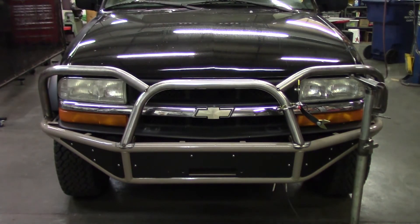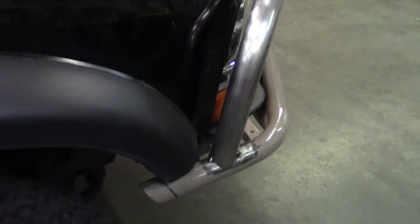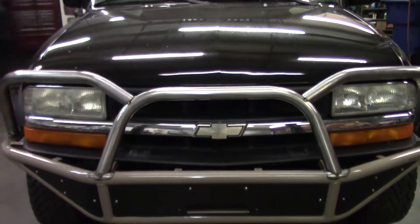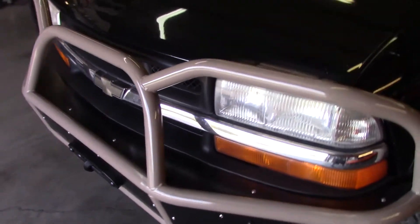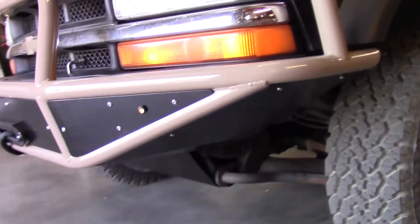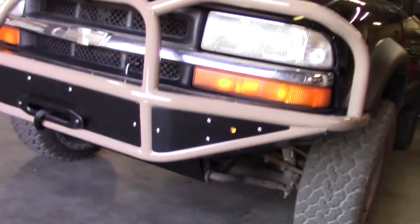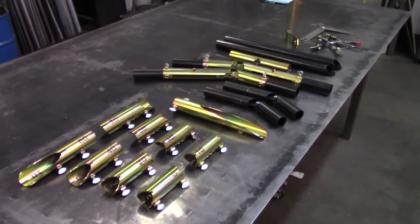Now I'm gonna give you a walk around to see what the bumper looks like from a few different angles. Here's the final bumper — you can see how the tube follows the fender line from this angle, coming up to the top where the tube follows the headlight and hood, and from the front you can see the mirror image on both sides. Here's the final bumper all welded and painted and looking great. You can see how clean these tubes look when they follow the body lines the way you want them to. Underneath I made some side panels and a skid plate, as well as mounted the winch. Stay tuned for the next video where I use more of our products to show you all the other fab work that went into finishing this bumper.